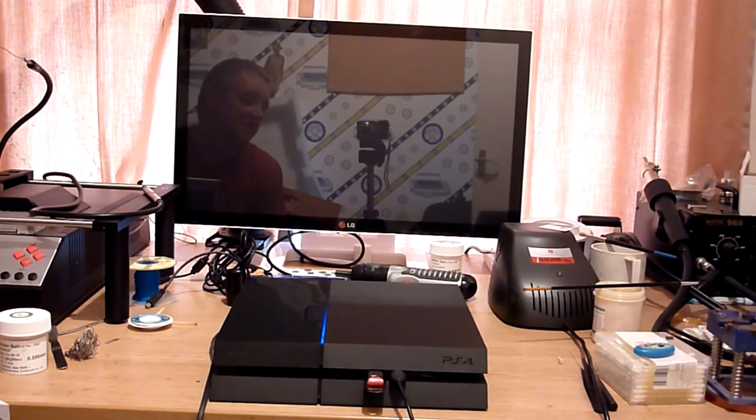So at this point the system is copying the firmware to the local disk before it shuts down. So it does take a slightly longer amount of time than usual to complete this step. So don't panic if it's sitting there flashing blue lights at you for a couple of minutes, because it's quite normal.